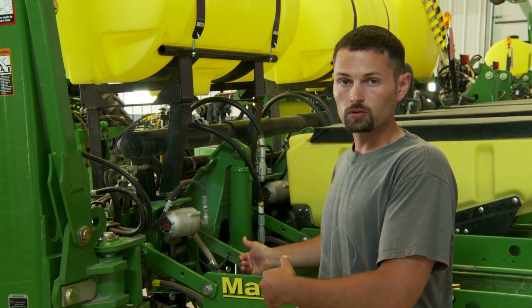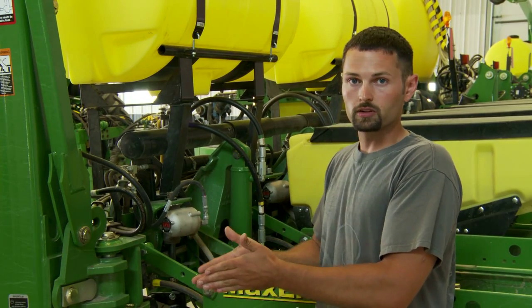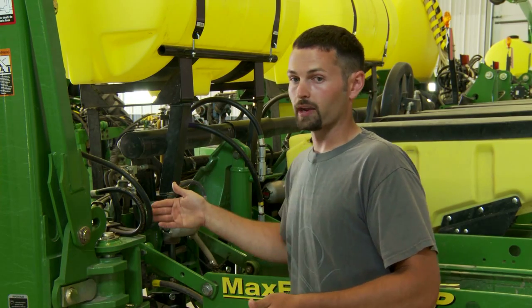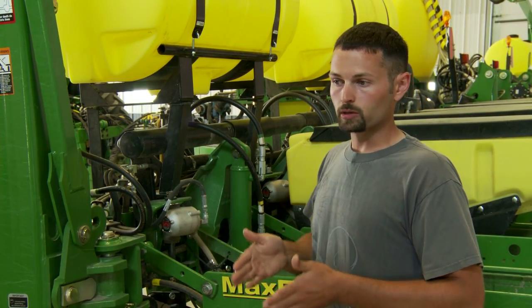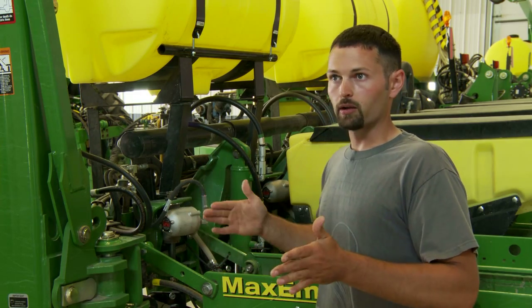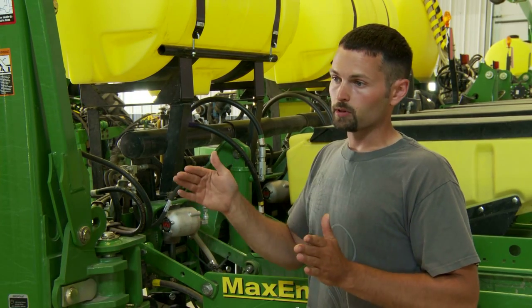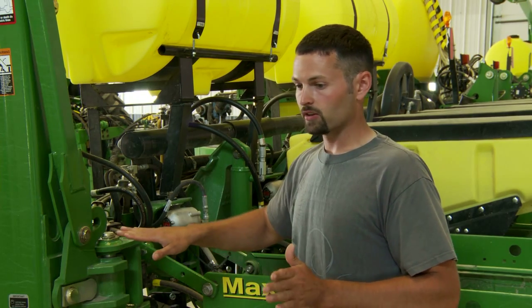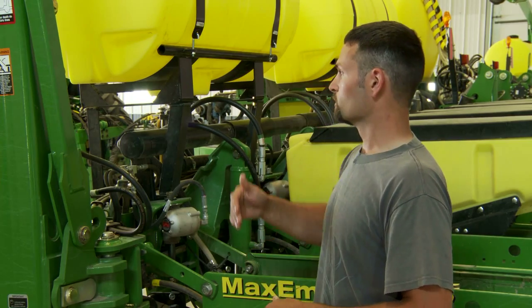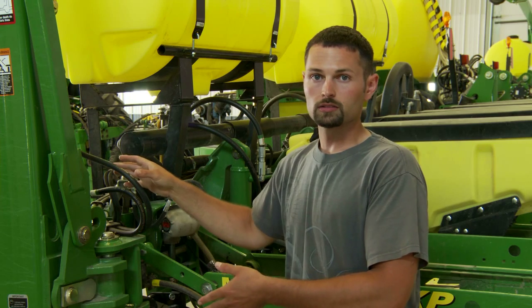I don't have a no-till coulter on my unit, so I'm not fighting the unit to get in the ground — the disc openers are just kind of falling in there behind the row cleaners. I went anywhere from zero down pressure up to 400 pounds at some spots, like on an end row where it's really compacted. I'd just twist the knob and watch my margin, watch the loss of ground contact percentage, and play with it. It's really hard to dial in a planter at the beginning of the year at 100 pounds and just leave it. We were constantly changing — from one spot in the field to 15 feet away, I could go from 400 pounds all the way down to zero pounds of down pressure.